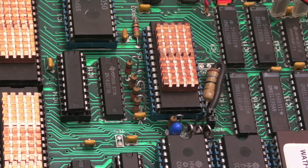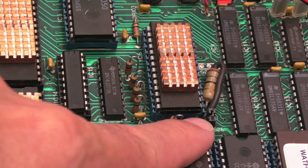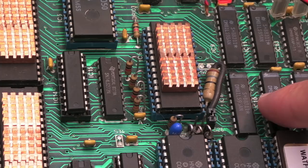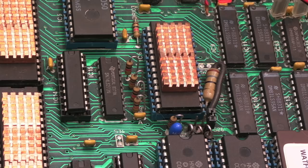If you've got the original ULA you don't need that little wire underneath, and the jumper works normally in either east or west position. But on the 2023 or the 2069 you need that wire — that's the key. If you've got the jumper on in either position you'll have problems: in one position it won't boot, and in the other you get weird dark-coloured text in anything other than the default mode.